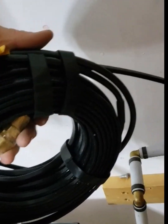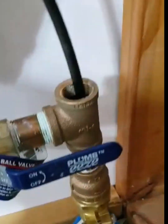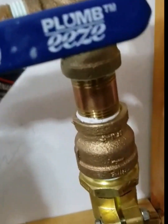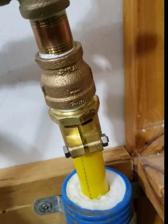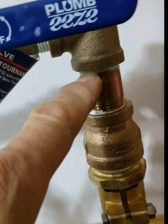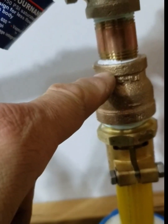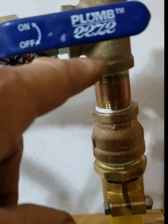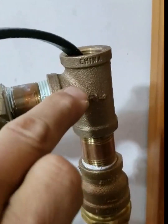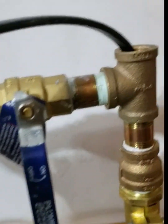This is the coil of heat cable and as we showed you earlier it's inserted into this three-quarter inch T. You'll need a three-quarter inch T in order to complete the installation. There's also a three-quarter inch nipple, and this fitting goes from one inch male NPT to three-quarter inch male NPT. This three-quarter inch nipple and three-quarter inch T will supply water to the pottery studio.